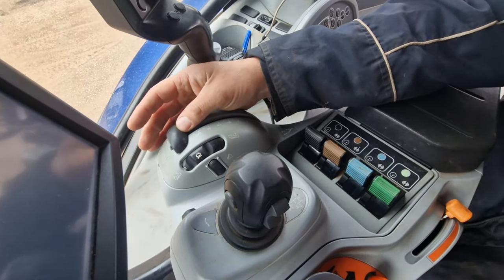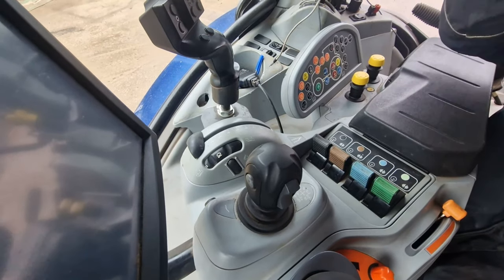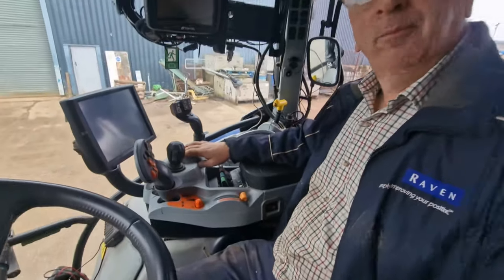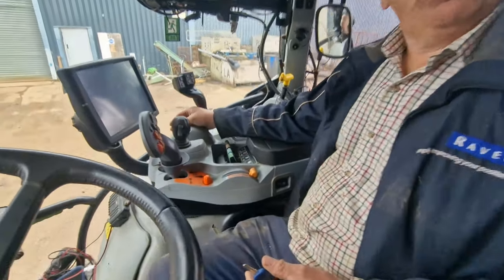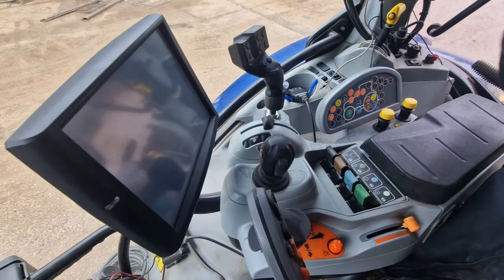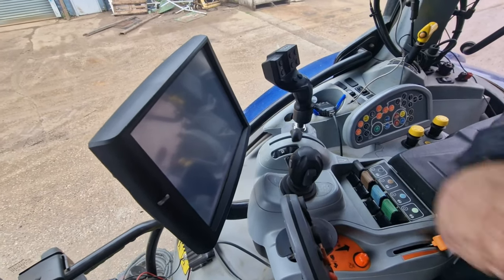The beauty of this one is, if you were plowing some sort of black land, sometimes you'll get what they call a chalky gulp going through the middle of it - where there's no actual soil but you're plowing up chalk. So you can actually set that at your max depth. So when the plow gets down to that depth, it doesn't bring up all that chalky material underneath that you don't want. You can actually set your minimum depth and your max depth here. That one you would use for such as fertiliser spreaders and things like that, where you just want a fixed position. Rotavators and bedformers are another one - they want a fixed position, because with a rotavator it's not actually pulling on the implement going into the ground, so there's no weight transfer.